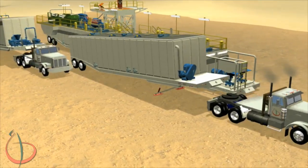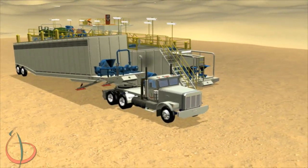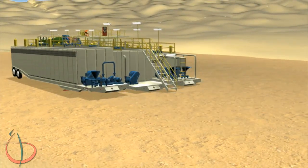Back up and set water tank parallel with the reserve tank. Hook up lines between the tanks. Hook up the portable HPU unit to the quick connectors in front of each trailer.